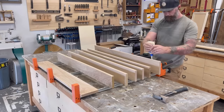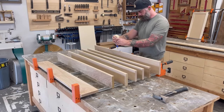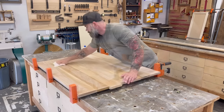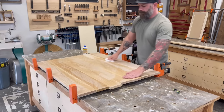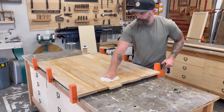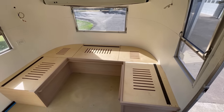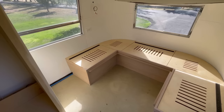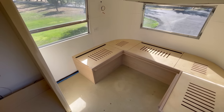I'm going to build the entire table at three-quarter-inch oak — if you're wondering how that becomes an inch and a half, don't worry, I have a plan. I took all my pieces, milled them up, stuck them in clamps, glued them together into one solid oversized panel — that's important — and set that aside.